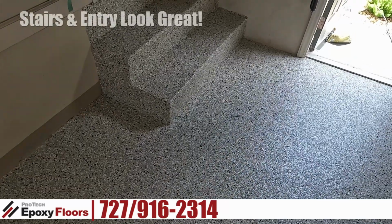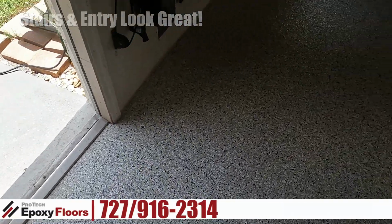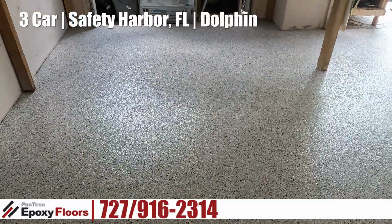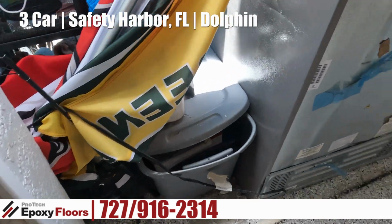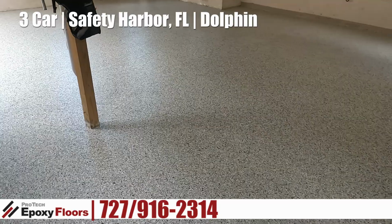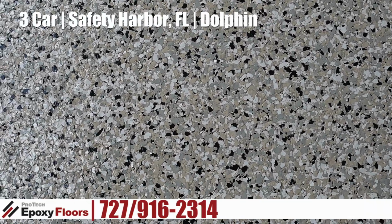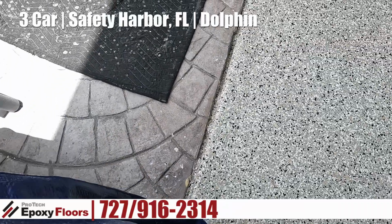Here's the stairs, all detailed and nice. These we ground and rounded over the edges. So this is a full chip job, polyaspartic top coat, and this color is Dolphin. And here's the lead-in edge that we ground and chipped over.